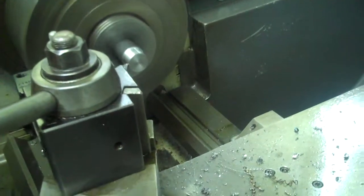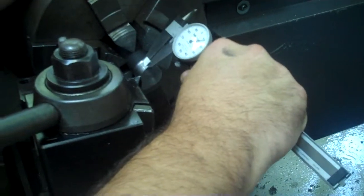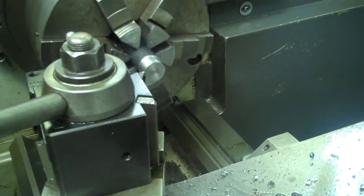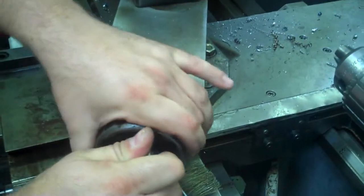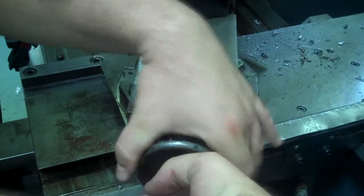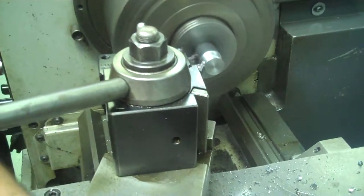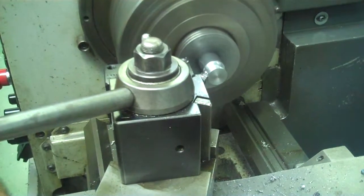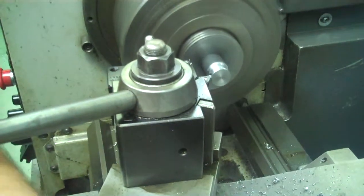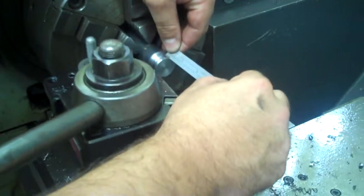If I touch off now and check — that looks better. I'm about 115, so that's good. Once I'm at this point, I'm going to use my compound rest to cut my angle. I'll come back here and start cutting from this point — that 23-degree angle. If you want to make sure you're back far enough, you can always use your scale to double check your angle and make sure you're at 23 degrees. I'm definitely back far enough at that point.